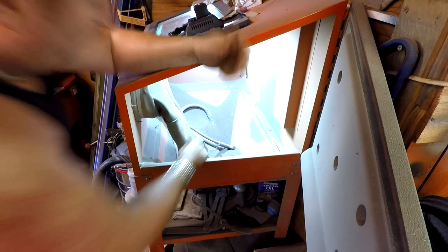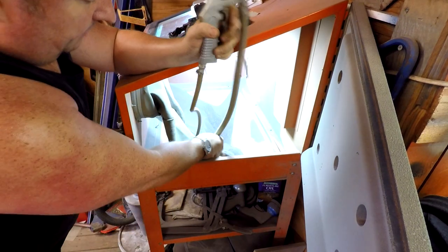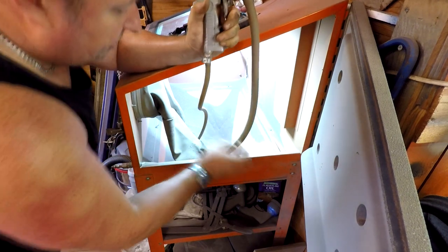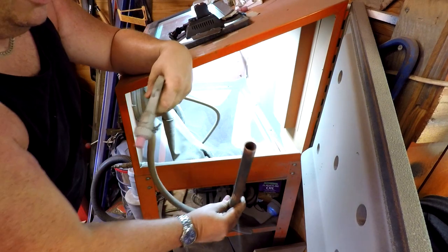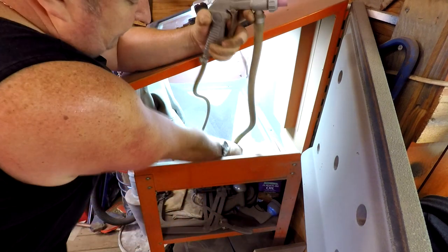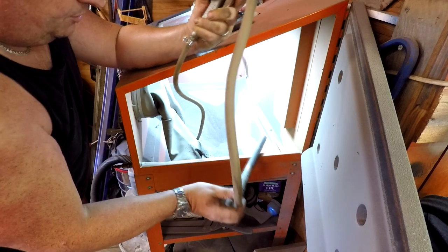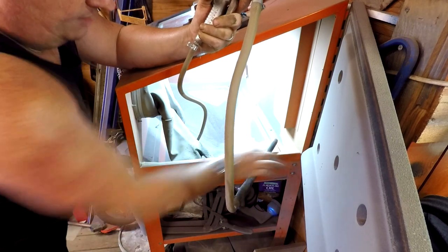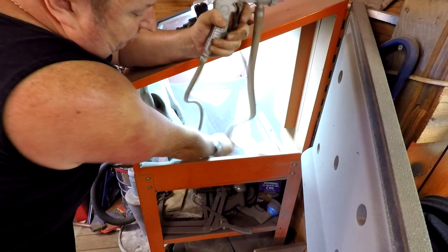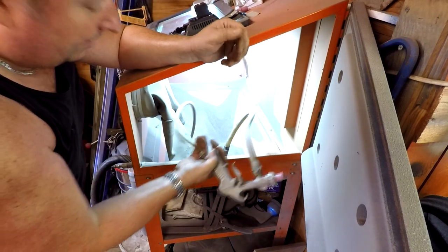So one other thing to note as well, these original guns that come with the sandblasters aren't really all that good. I took mine out and it kept blocking up with that small little tube that they supply you with. I put this on, which is a 22 mil, I think, copper, but that's not really the correct job, because when that goes down, it needs a separate tube going along down with it, which I'm going to modify so it can suck air in as well. This isn't the right way to do it. It does me for now. And every time I have to keep stirring it up when it gets too bogged down and it can't suck the actual stuff up. So I've got to make alterations for that. When I do it, I'll show you anyway.